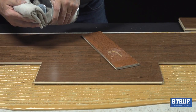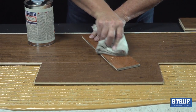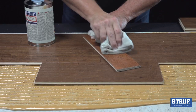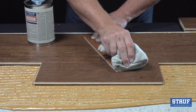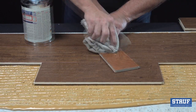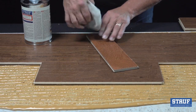As with any installation, there will be messes, which can be costly with moisture-cured urethanes. WFR 930 may be cleaned wet or cured, like this board shown here, with acetone or mineral spirits. A lot of adhesive may require a little more elbow grease, but it can be removed, leaving the finish on the board completely clear of adhesive residue.